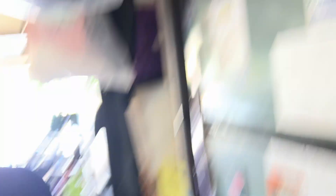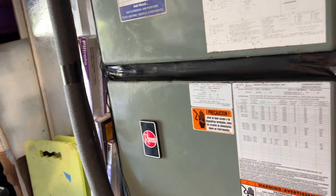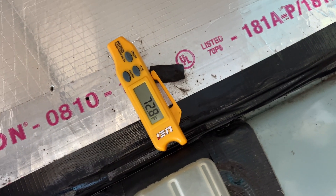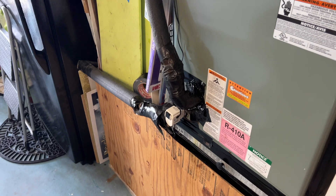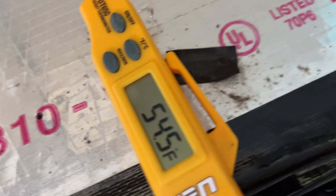Put it in that hole and see what it says — 75 — and then I'll go ahead and enter that here. I'm going to put 75 in and watch this drop. I always like to check the drain lines before I leave to make sure everything's draining. The temperature differential benchmark we use is around 20 degrees.